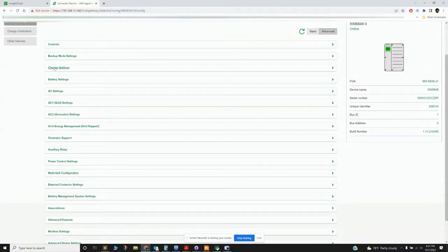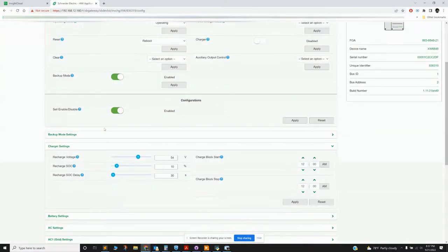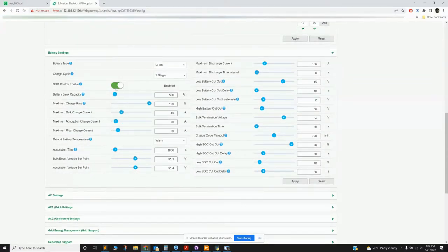And if you wanted to charge your battery, for example, you would have to go in here and set operating to standby, click apply, then enable the charger, and click apply, then go back to operating and click apply, and then come down here to charger settings and make sure that everything is okay here. And then in your battery settings, you need to decide whether you're going to do state of charge control, which is, are you going to charge up to a particular percentage,